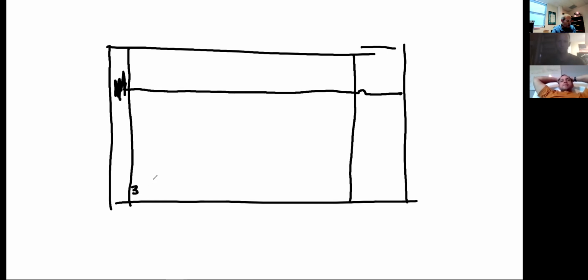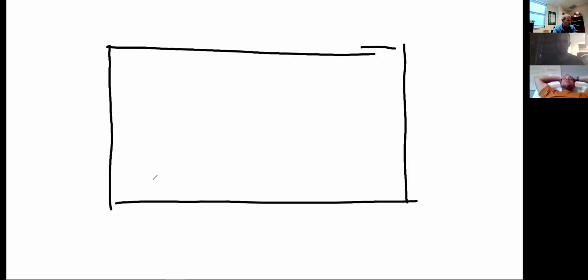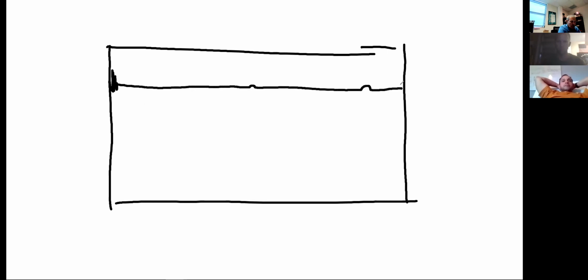If there's a fault in the cable, it's going to have a bunch of these squiggly lines at the front. It's going to go out. You're going to have maybe a small diversion right here, and then the end of the cable right here. Then he's going to press the knob. This is the second part where you press the knob. Another trace is going to come into the display. It's going to go down like this, and guess what happens to that little hump right there?